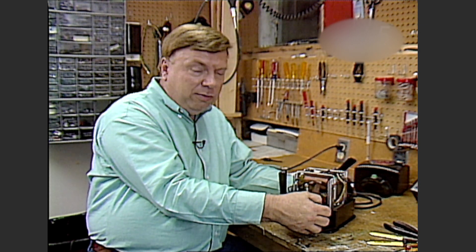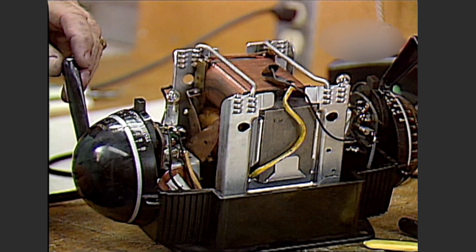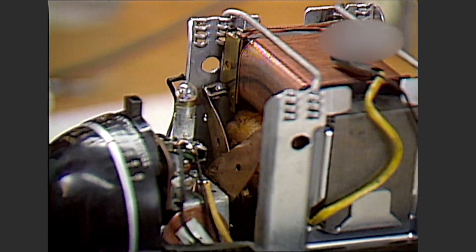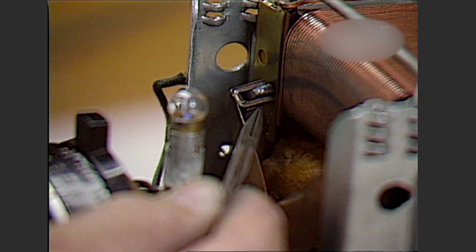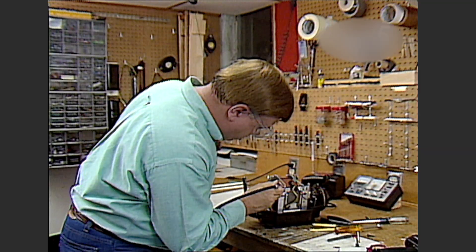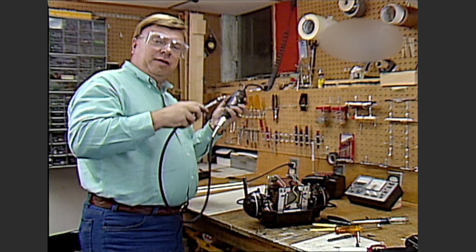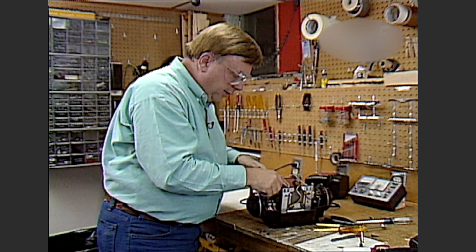We need to replace the worn-out roller. The roller that's doing a good job needs no replacement and is good for another 20 or 30 years. Let's move the handle down so the good roller is back where we have the most room. We're going to remove the axle pin by grinding off the peen on the bottom side, then pull the pin out and replace the roller. Let's get our Dremel tool in and very carefully grind that off. Now we can reach in very carefully and lift out the axle pin and the bad roller.